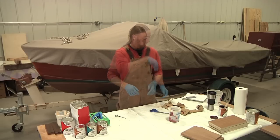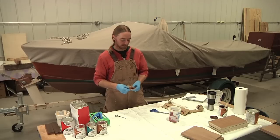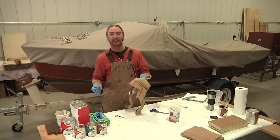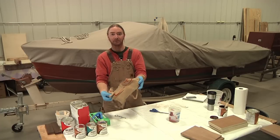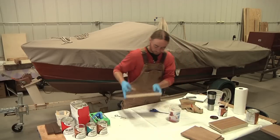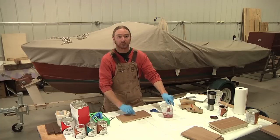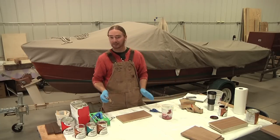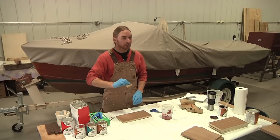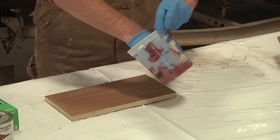What I actually prefer to use is burlap cloth — you can also use cotton rags or t-shirt rags, but I personally prefer burlap. I scavenge the bags that our basmati rice comes in — nice big heavy burlap bags — and I cut them up just for this. I'm going to saturate the rag pretty well and put a very heavy coat of the stain on the wood, then let it sit for about ten minutes until it starts to glaze over a little bit.